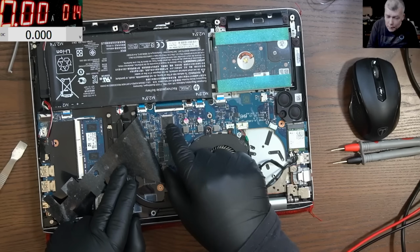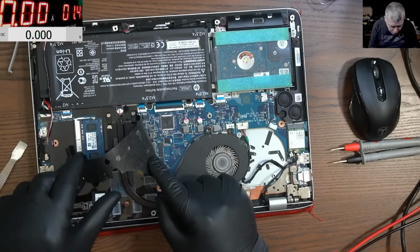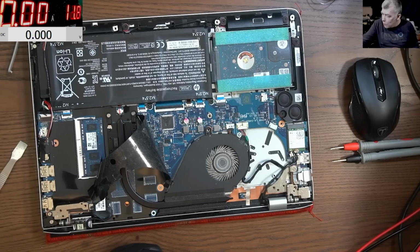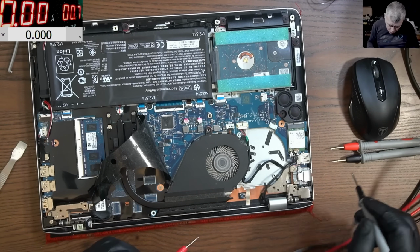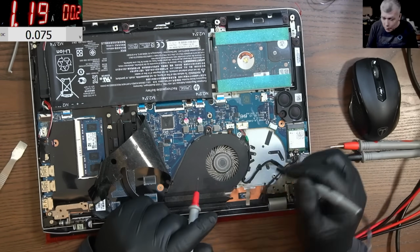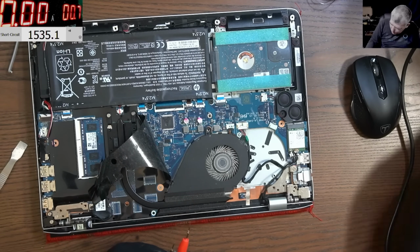We have the startup chip there. We have some power supply, so we can check if we have a short. No 19, no. Maybe you have a shorted MOSFET, we don't know. Ground, short, on the other side short. Okay, so checking with the multimeter. I mean, it will be no difference. Indeed we have a short.